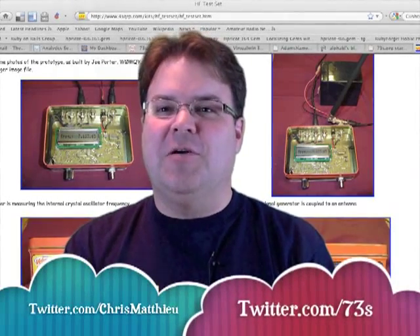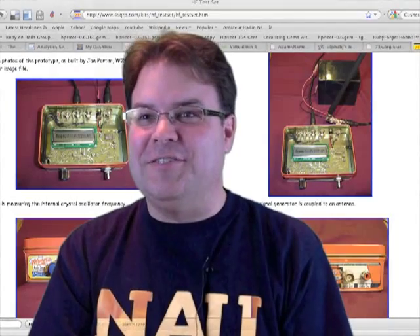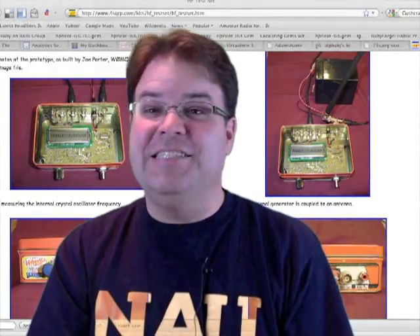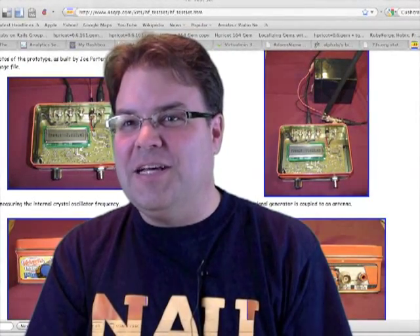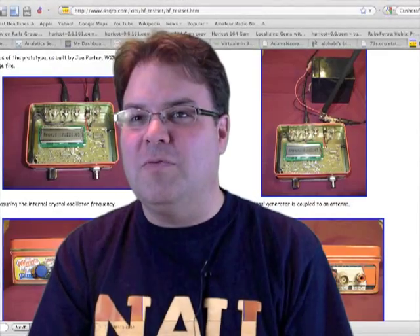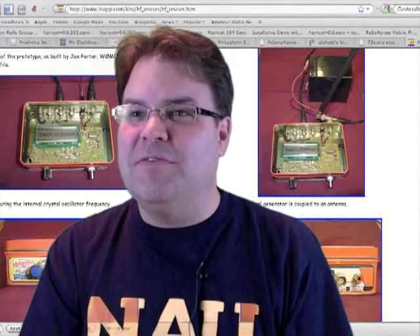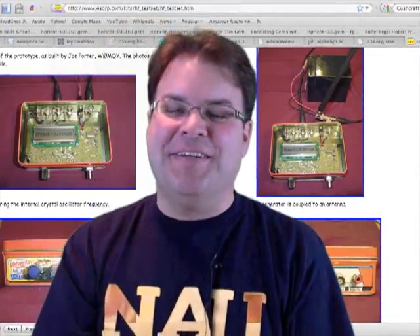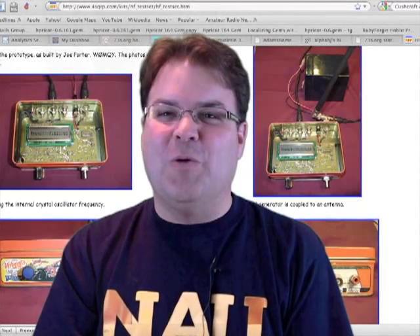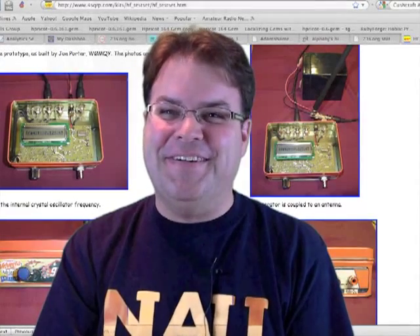If you follow me on Twitter, you probably saw me tweet an interesting project box this week. It's an RF multi-tester function test set, built out of a little aluminum Altoid-type box. Listen to all what it has in it: a frequency counter, crystal oscillator, wideband noise generator, audio oscillator, 50-ohm dummy load, RF probe, and a time domain reflectometer. It was designed by Wayne McPhee, NB6M. The link is here, and you can go to his site to learn how to build the box, or you can buy one already built from him for around $55 US.